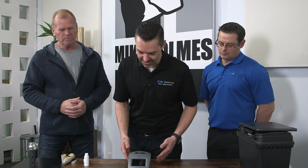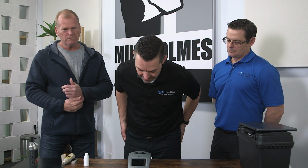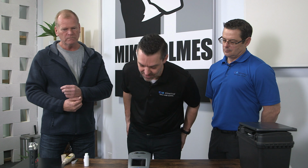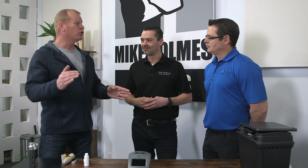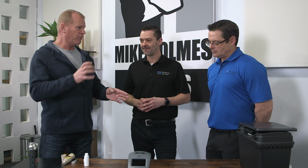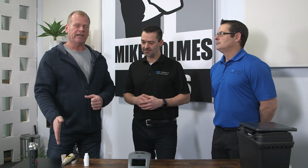So the readings for yours: we came out with a pH of 7.7, alkalinity 102, and hardness is down to 29 grains, and that's fluctuated a little bit. Holy cow, that was at 60-something at the beginning, and now it's right down. So it's down to a controllable number. Yep, for water softening, much more controllable. Okay, so our TDS is at 810 parts per million.